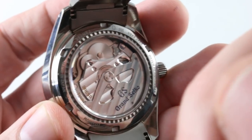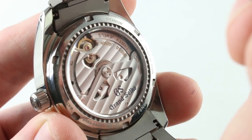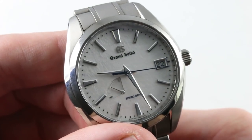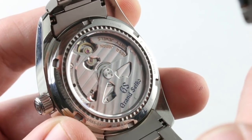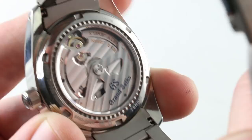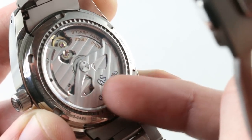Let's take a look at it from a couple of angles. Three-day power reserve, automatic winding. What you have here is a spring that is manually or automatically wound. It acts through a conventional drivetrain pivoting on lubricated jewels, just as you'd find in a Swiss automatic, with hands powered by the collected spring energy of the mainspring acting through the drivetrain. But between the hands and the barrel, there's a governing wheel that moves only in one direction — not a bouncing balance like a Swiss movement. Rather, it's a governor that creates an induced current from the mainspring barrel. The motion of the wheel creates that induced current, which wakes up a quartz oscillator. The quartz oscillator then creates a back EMF to slow down the governor wheel when it gets too fast, regulating the speed of the discharge of the energy from the mainspring barrel. So you have no battery, no capacitor — only spring storage of energy and mechanical drive of the hands.